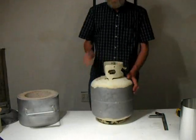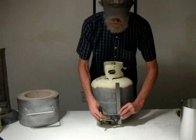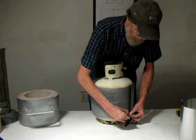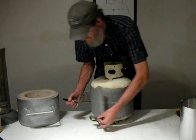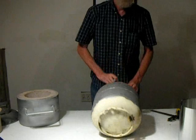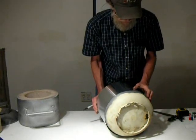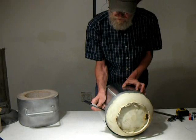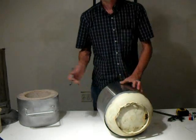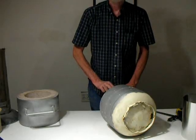I already have this tank on. I've gone ahead and removed the tank valve and sandblasted it just to save some time. I've got the square assist. What you do is make just a few marks as you go around on the three-inch mark. Flashing makes a real good straight edge — just line it up to the mark and mark it. Do that all the way around, get both marks marked, and then go ahead and cut. This tank has been drained and rinsed three times, so it's fully safe to cut into.